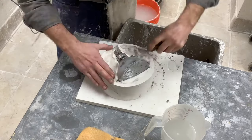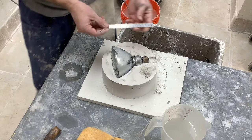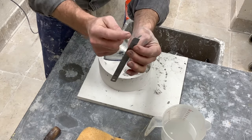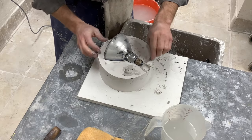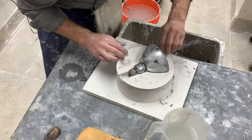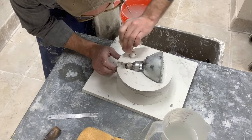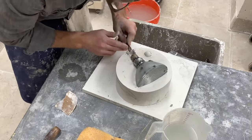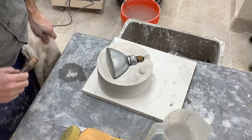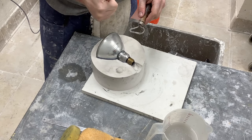Using that same loop tool or a straight edge, clean up the top part of the mold. Carefully identify the seam line — you can use a ruler or a small straight edge with a 90-degree corner to get a very clean seam between your object and the mold. Sandpaper works well too. Clean up the key made with the screwdriver, and clean up the pour channel. Go back with water to wipe away all crumbs and excess clay.